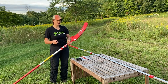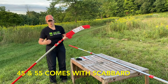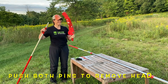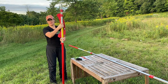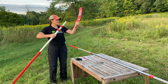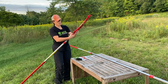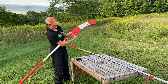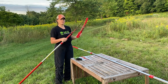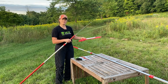Two features that I like about the 45 and 55 is they come with a scabbard for the saw. When you want to stow this at the end of your work day, you can pop off the head by pushing both pins, and this packs really small in the back of either your work truck. If you're running the 33, it packs in the back of your car. With that scabbard, it protects you from being cut — it's a nice thing to have. To release it, you actually have to pinch the bottom piece and then this piece slides over that, and then your scabbard comes off. That little lock is important because without it, that scabbard could potentially fly off in your car, and that'd be a bad day.